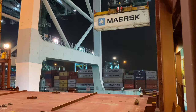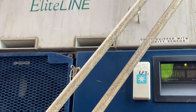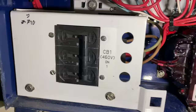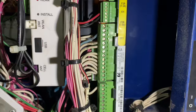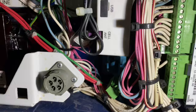Carrier has three different models. Carrier is similar in simplicity to the Star Cool, but the only problem is this unit uses a thermostatic expansion valve which gives you limited access when changing it. The control panel is the simplest of them all — you can have your test points on each and every terminal, and replacement of each component is very easy.